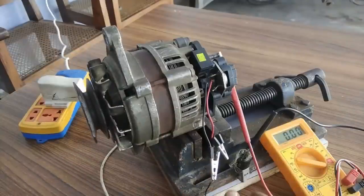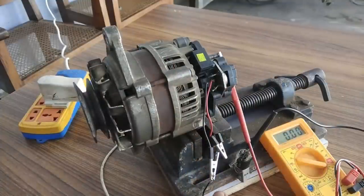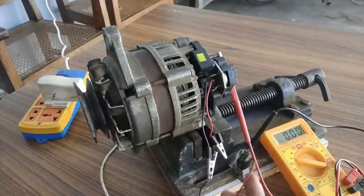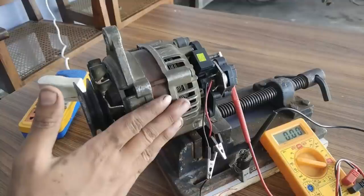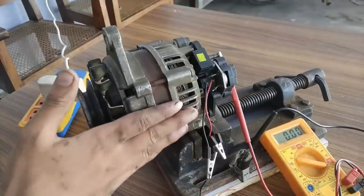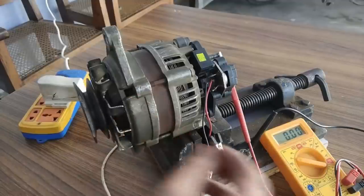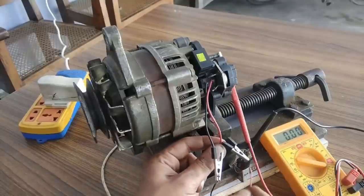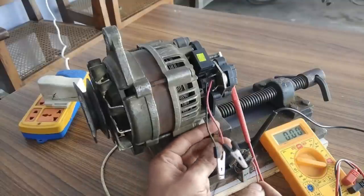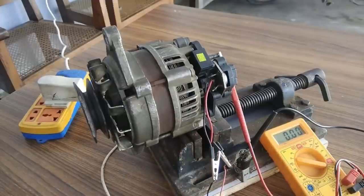Okay, so guys, I disconnected one of the supplies because I had to connect the output terminals of this alternator to the multimeter. And for a second, when I connect this terminal to this terminal of the brush, the alternator will act like a transformer, and you should see for a second some amount of voltage indicated on the display. Okay, yeah, you can see 0.65 volts. Yeah, 1.53 volts, and now it is zero,